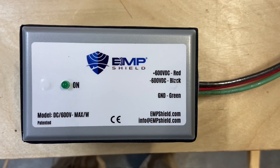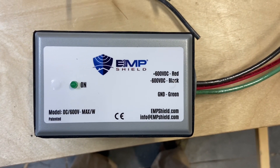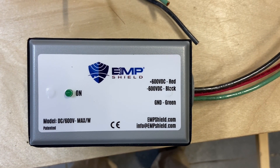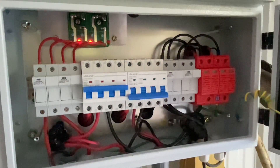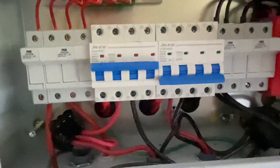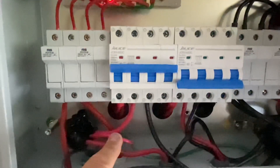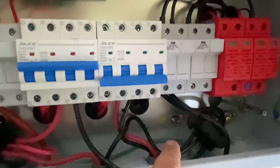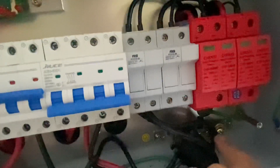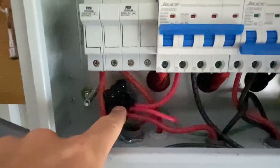Here's the single string version — same 600 volts DC. You'll just have positive, negative, and ground on this one. I'm going to hook this up to my single string, the 8,000 watt array, in the combiner box out there. Here's the combiner box where I have the solar array built as a roof. I did the same thing here — I basically used the combiner box as a junction box for the lightning protection. Here's the lightning protection in the three-way connector, here's where it goes into the inverter through the breaker, same over here with the negative, and behind here I hooked the ground into the ground bar. It was really simple with these three-way connectors.